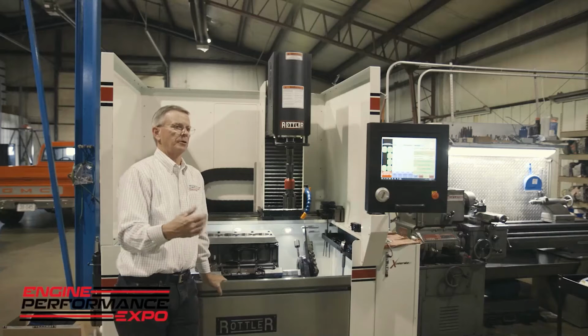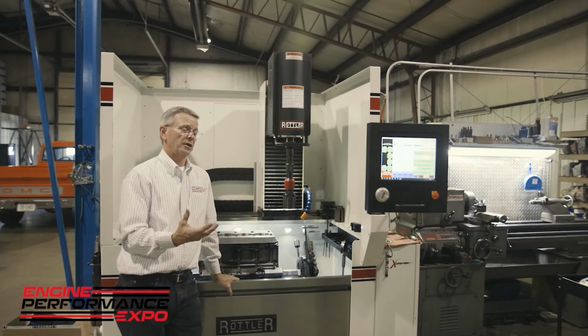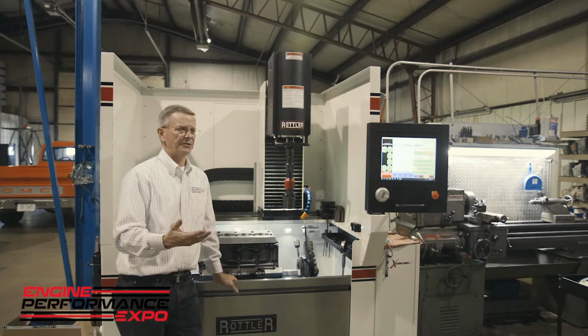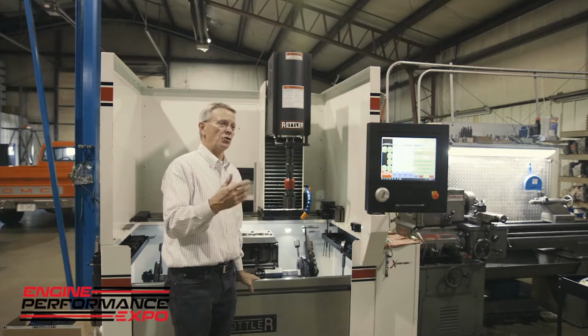Okay, so Tyler just changed our abrasives from a 180 grit diamond out to a 600 grit CBN, cubic boron nitride. We like CBN because it's a very sharp particle, unlike diamond, which is a very strong particle, but it's a dull particle. So when we're cutting with diamond, diamond tends to pull and tear the material more than it cuts it. And I use the analogy, if any of you have a garden and you till it up and it's real fine dirt, if you take a dull stick and pull it through the dirt, you end up with a mound of dirt on each side of the trough and a mound of dirt where the stick stops. That's a diamond. If you take a very sharp stick and you pull it through the dirt, you get much less mounding and a nice clean groove or ditch. That's a CBN abrasive.